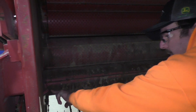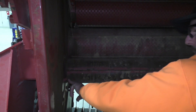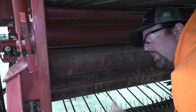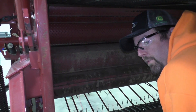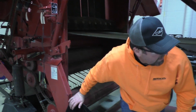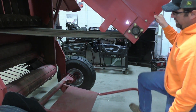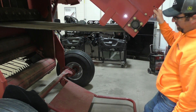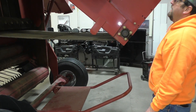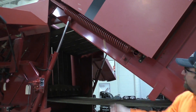This is actually our bale shape sensor — it's literally just a piece of metal here pushing that potentiometer in to show the shape of our bale. So instead of watching belt tension, they're actually feeling the bale itself, which is kind of unique. Our bale ramp is just spring loaded, so that's going to eject and when that bale rolls off it's just going to lift up. We've got a big tension spring right here for our belt tension as well.